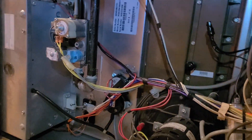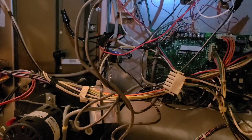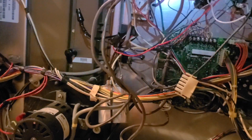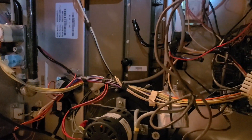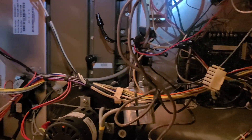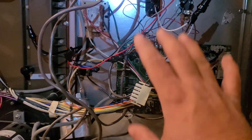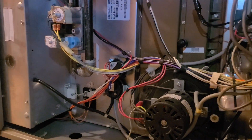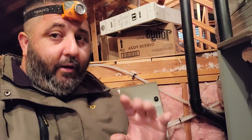That's really the only solution to this. The particular reason we're doing this and not going OEM is this is a York — a very expensive furnace. The blower motor costs us $1,300; we'd have to sell it to the customer for $1,500 to $2,000 just to make a profit. We called around and nobody in the entire United States had one — not even the factory — with no lead time on when one would be available, meaning they'd need to buy a new furnace. This happened right before Christmas, so we got them heat through Christmas and New Year's. By putting the sequencer in, we avoid all the issues we'd normally have. That is how you change out a variable speed blower motor with a PSC.